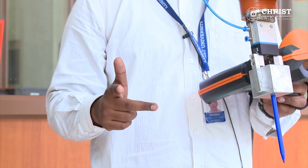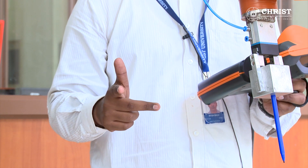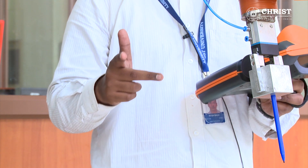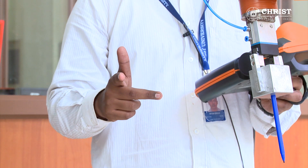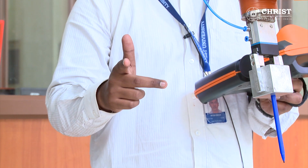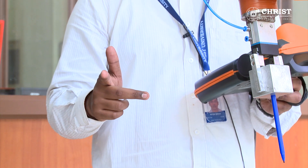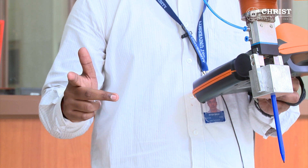In the world coordinate system the robot will move according to the right-hand rule. The thumb indicates the positive Z and negative Z direction. The index finger indicates positive X and negative X. The middle finger indicates positive Y and negative Y.